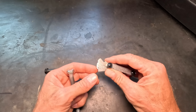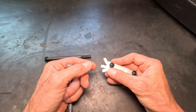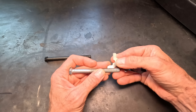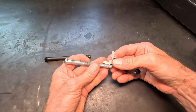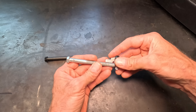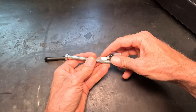I'm going to check 15, 16, and 18 — the three that are in alignment. If I put 15 in here, you can see it doesn't quite sit right; it rocks and won't sit down in the threading. If I take 16 and put it in, it matches perfectly — doesn't rock back and forth, fits snugly, just like it's supposed to. If I take 18 threads per inch, same thing: I can't get it to physically sit down. So this particular bolt is 16 threads per inch — that's how it works using a thread checker.